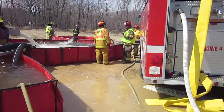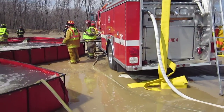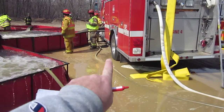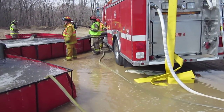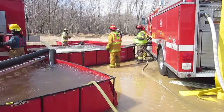So now the trick is going to be, this is a 1,250 pumper. We're flowing 1,250 running two jet siphons. He has a two-and-a-half inch suction in — you can probably see that right there — they dropped that in early, so in effect he's probably a 1,500 gallon a minute pumper. No interruptions in flow since we started at the five minute mark.